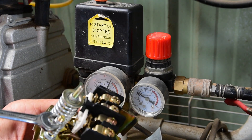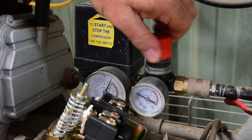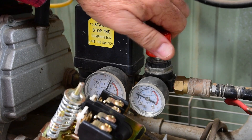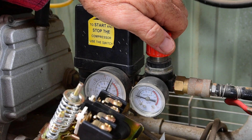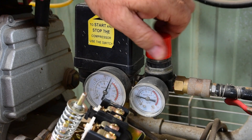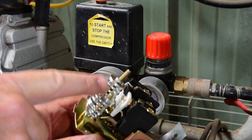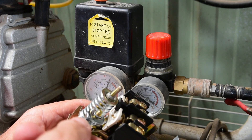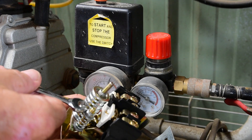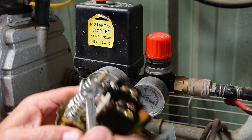So I want to wind this one up. Let me just double check the pressure it goes off at, and check the pressure that the pump comes on at. That's near enough 30 — pretty close, about the thickness of the needle — and the pump is going off at 55. So I've got this adjustment here, I just need to wind this one down a little bit. Because you want a little bit more pressure on that spring, I'll wind it up a fair way. I probably should have been counting the flats, but never mind.